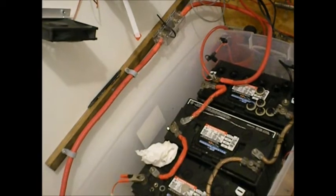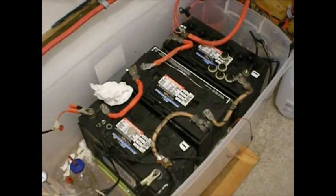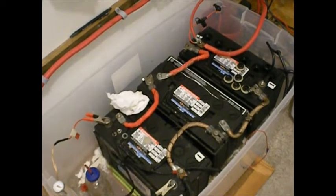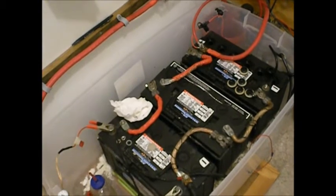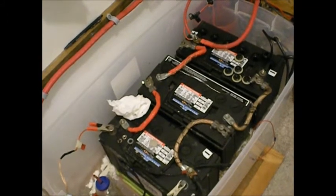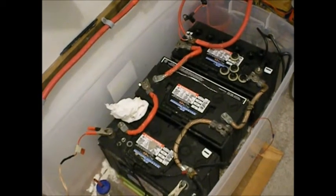I think I'm running about 380 watts off one solar tracker, just to keep these batteries charged up and running. I'm going to be adding a five cubic foot chest freezer and just run it off my inverter, so these things are always getting a little bit of a workout. They only draw about 480 watts max, and in between that they're not drawing very much at all because it's a freezer — you don't open it much.